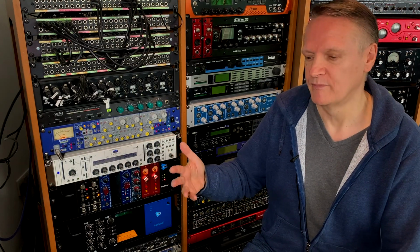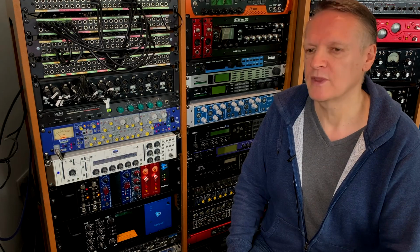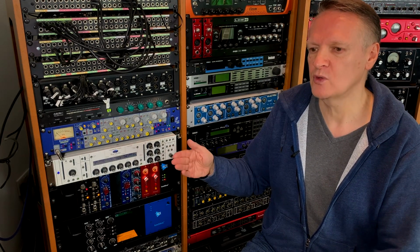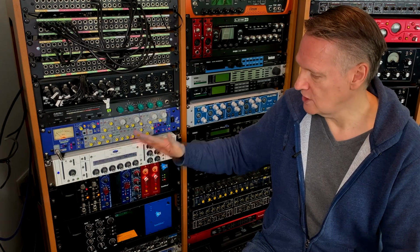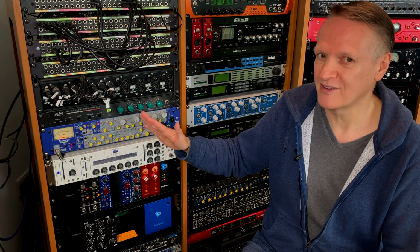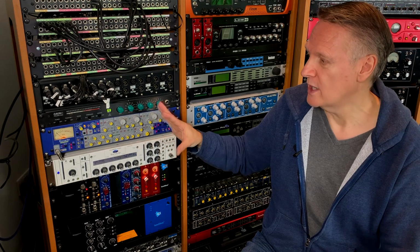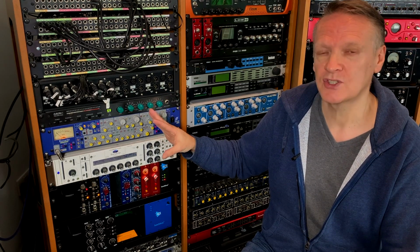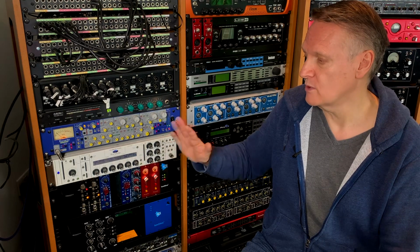I'm going to make one other point, and that is that some microphone preamplifiers are built to introduce harmonic distortion. And of course, those are the ones that have tubes in them. And that's just great. That's fine. I've got no problem whatsoever with innovative and interesting designs that actually attempt to actively and audibly alter the signal that they're amplifying. That's great. I don't happen to have any tube amplifiers at the moment. I did have one originally, which was a Tony Larkin's audio voice channel, which was great. I don't at the moment, but unless you intentionally want to change the sound at the microphone preamplifier stage, a transistor-based or digital-based microphone preamplifier will probably suit you best.